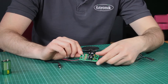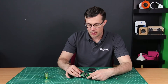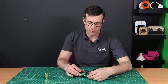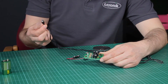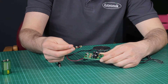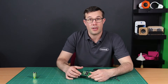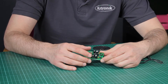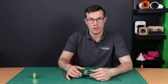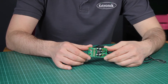So here we have the next kit in our range which is a stereo amplifier kit. The PCB is slightly larger and has more components on, but this time it can power two speakers and it's stereo. So we have two paper cone speakers — the same speakers that we have in our mono amplifier kit. Again we have a 3.5mm jack to connect to your audio device. This time power is provided by a 9V battery so we have a clip here to connect to this style battery. Again we do this in two versions: the self-solder version where you have to solder these parts in, or a pre-built version where these are soldered for you, but in both cases you still need to connect the speakers and external wires. This kit can output about one watt per channel depending upon the voltage of the battery you're using and outputs a nice quality sound.